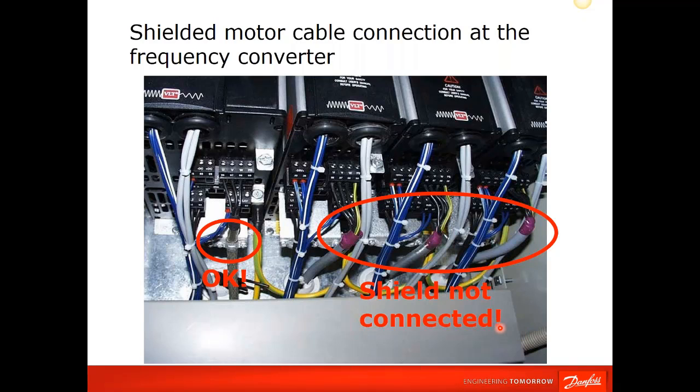Look at your power wiring. On the motor side, RFI is radiated from the motor cables. So any RFI energy is going to be going out and exposing other equipment to that noise that's generated there. And RFI is conducted on the mains. So if there's other machinery that's causing noise in the facility or inside the enclosure, it's going to be conducted through the ground plane up through the mains. So that's why Danfoss is very concerned about this and wants to do best practices.